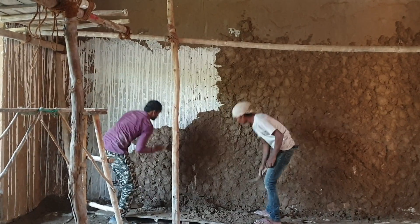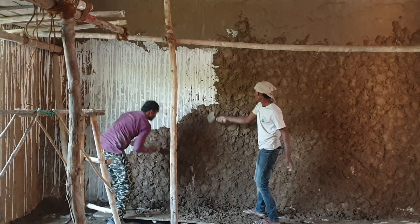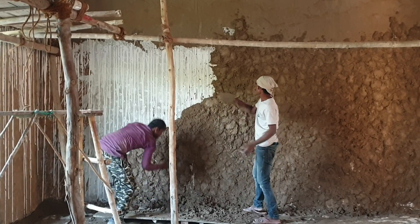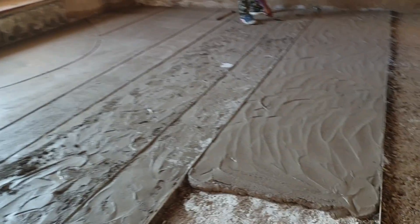Most of the walls in our house we did not find the need to plaster, but wherever we have used plaster — either to cover up our mistakes or to bring a certain color and texture into the room — we have plastered again with a mix of lime and sand. Even in our floors, the bedding mortar was a combination of lime, sand and ash.